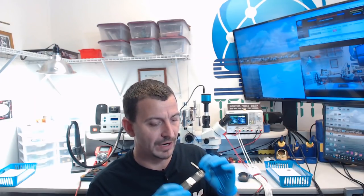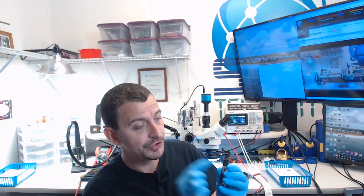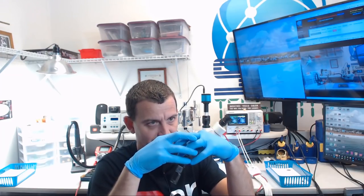I'm going to do a data recovery on an iPhone 6S that was sent here from another data recovery company. I've started this one early in the morning because this one is going to need ultrasonic cleaning. And after ultrasonic cleaning anything with an A9 CPU, it's time for some really, really intense drying, because if you've got moisture under the A9 CPU and you heat this thing up with a hot air gun, the RAM tends to bulge up and crumble into bits. It's a really, really gnarly thing. So let me show you why I'm going to ultrasonic clean this one.